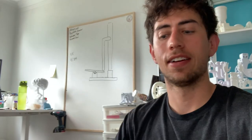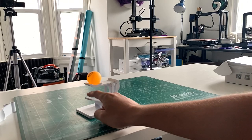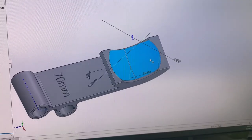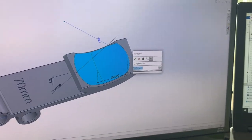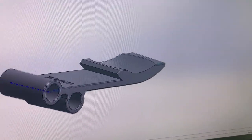The arc was definitely better there but not enough for what I'm looking for — I really want it to go like that. Let's try the 70. The 70 was still not quite high enough, so I'm just gonna change this dimension to 80 millimeters, print that, and see if we get a better improvement.